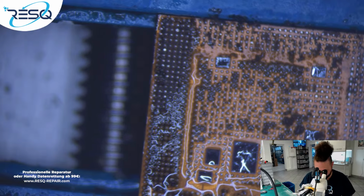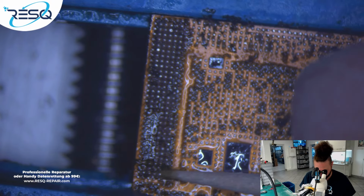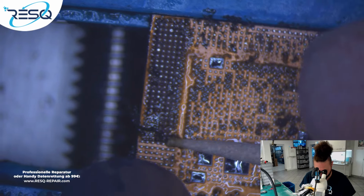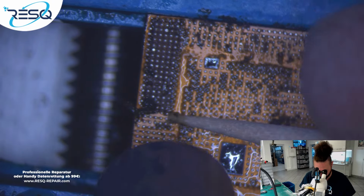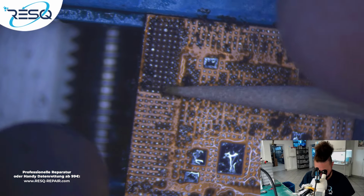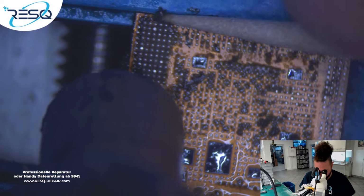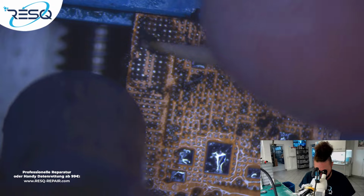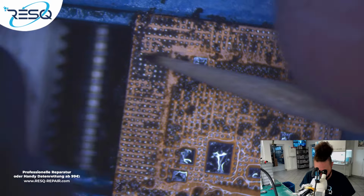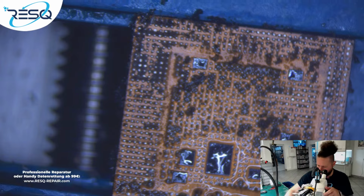Turn one time. And you see the solder doesn't melt, even if we have low melt solder. So you see I don't use much heat, because I don't want to overheat the CPU. Takes more time for getting out the glue, yes, but it's a safer working method, okay? So, one time cleaning between. It's always important to get a nice and clean look.